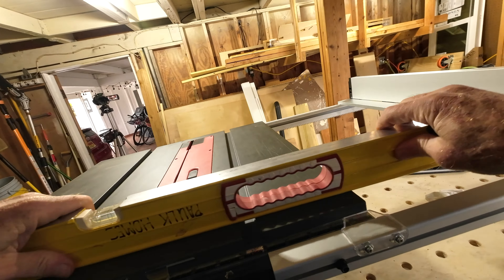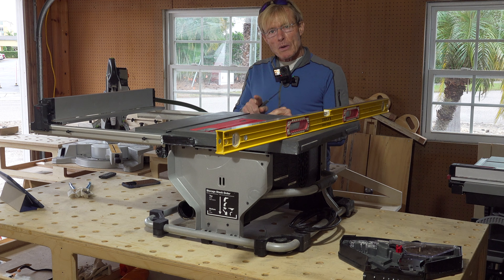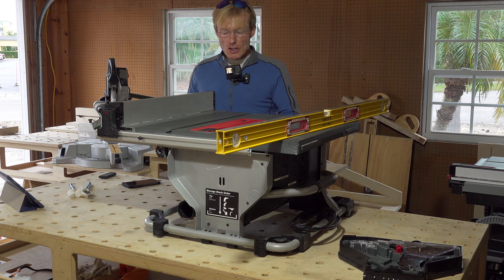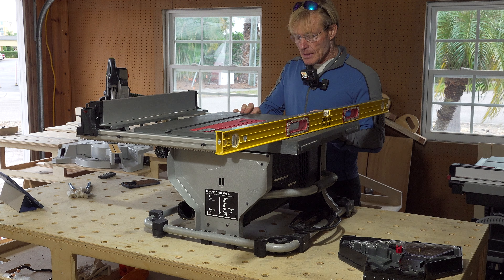So I will knock mine out of adjustment and make it have a little more flex. Take my 3mm Allen key and this taper or shim will move — it'll move about an inch or so. I'll go all the way back with it and now I've got quite a bit more movement. Again, this would not impact the accuracy or quality of the cut. My support is still at the same place because that's adjusted with the puck. That's all the way as loose as it can go.